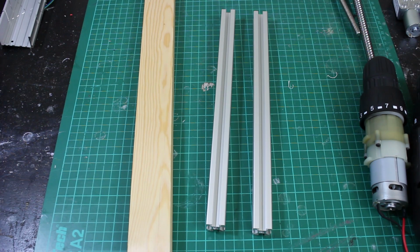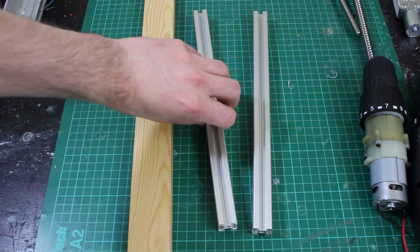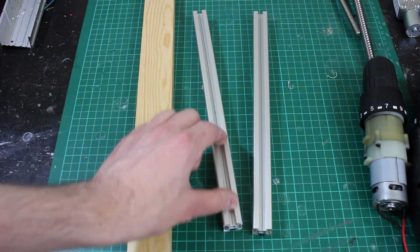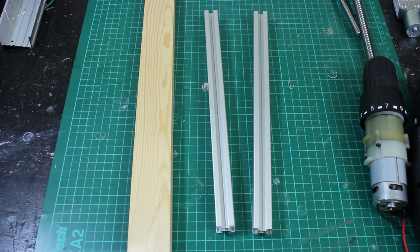I mentioned last time that instead of making all of the parts 3D printed, obviously this droid is going to be quite a bit taller, so the parts won't necessarily fit on the print bed anyway. We're going to use aluminium 2020 extrusion, and it's got these grooves in. You put a nut in, and you can bolt things onto it, and of course that makes it reconfigurable because we can slide them up and down afterwards and change the pivot points and easily change the structure.